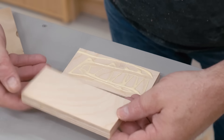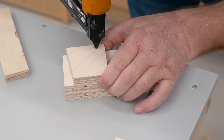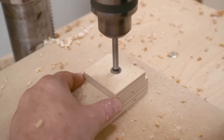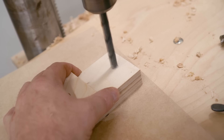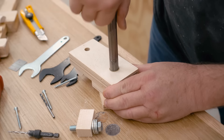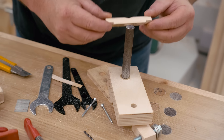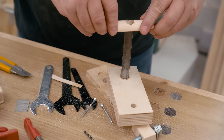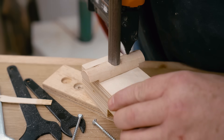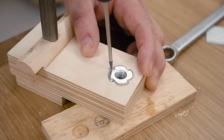The parts that I'm gluing up here will make the axle mounting block for the upper wheel. This needs a hole for the axle, of course, and it also needs a smaller hole for the tilt adjustment screw. I got the axle cut to the correct length and roughed up one end a little bit so that it will grip the glue better as I glue it into that mounting block. I also need to glue that pivot pin in place. While that's drying, I can get the T-nut installed in the axle mounting block — this is for the tracking.